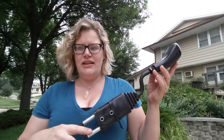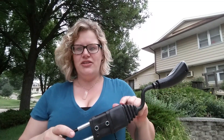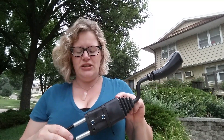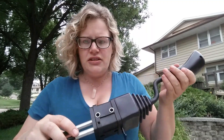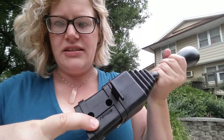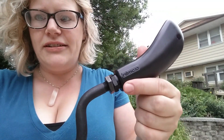What happens is the cables — the tips of the cables up inside the base — and then also there's a triangular joint and a pin inside the base that go bad over time and often need to be switched out. So what this video is going to do is show how to switch out the cables and those internal pieces. Just to make sure that you've got the same joystick we're talking about, it has the name Nimco stamped on the base and also on the handle.